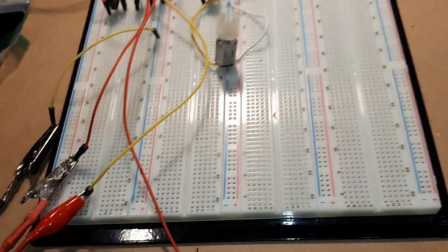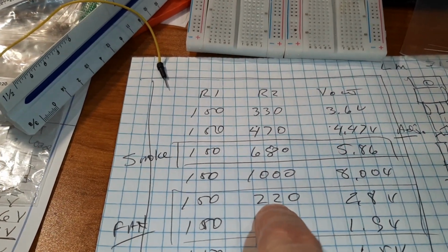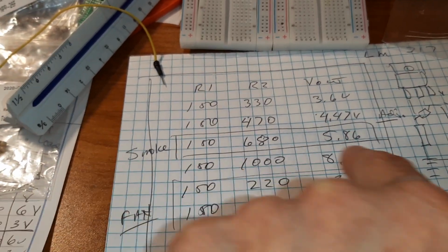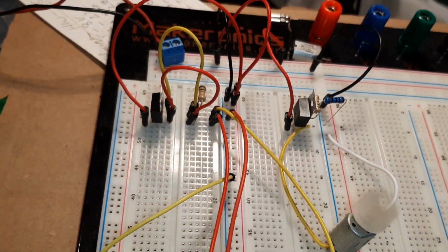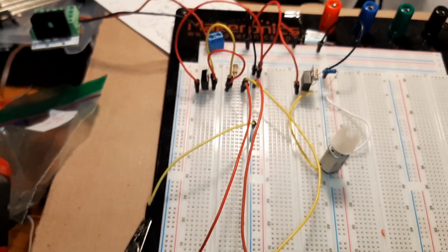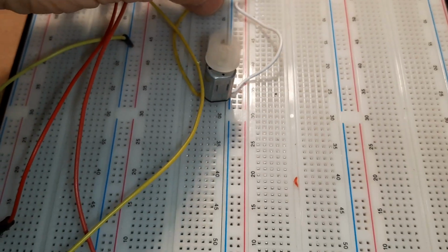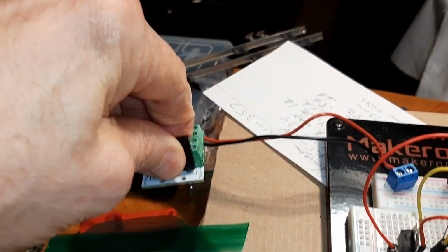That fan speed, I might want to slow it down, but as you can see here, if I want to give it a little less voltage, I just drop it from 220 to 100 or somewhere in between, and I can dial that in. And the beauty about all of these is if I use these as resistors, the user can't sit there with a trim pot and dial it up to 9 volts and burn out the heater, or 9 volts and make the motor fly apart. It will be a fixed, steady state every time, and cool as a cucumber. I mean it, not even warm. And he's not warm.